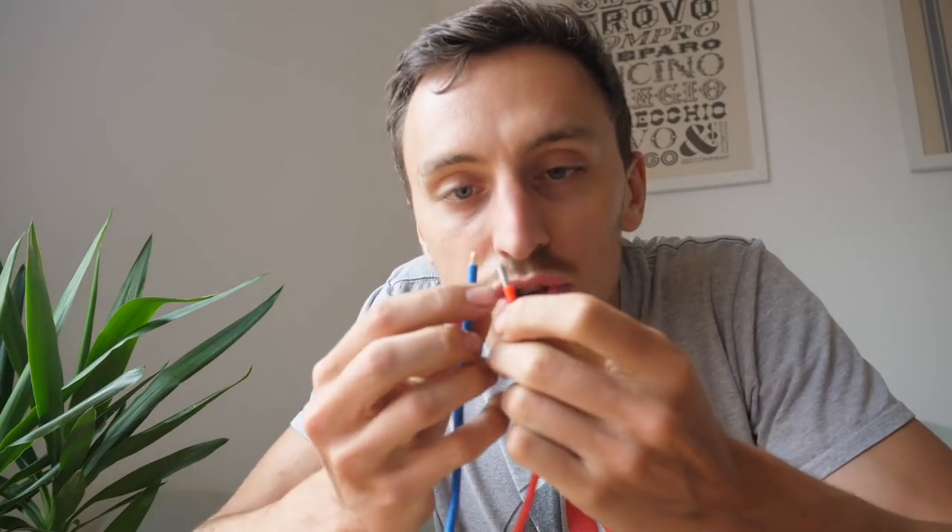To start off with, you have AWG or millimetre squared. AWG is more American, millimetre squared is metric — they represent the thickness of the wire. In AWG, 1 would be very thick cable whereas 40 would be very thin. In millimetre squared, 1 would be very thin and 40 would be very thick. I would personally advise using a higher strand count in your wire in a camper van because even if you pin your wires down, there's still vibration and movement. You want a more flexible cable — otherwise the stiffer stuff could bend, stress fracture, and then you've got a dud cable somewhere.